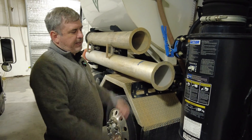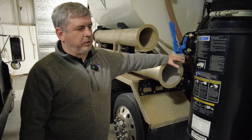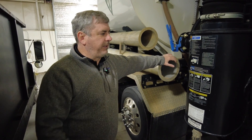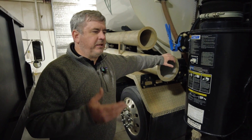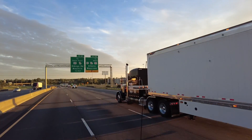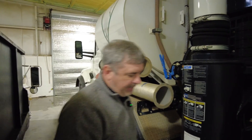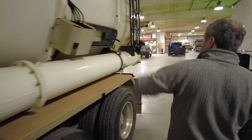The 28 inches of mercury is minus 14 PSI — that's not technically correct, but it's a good way to think about it. The factory gross on it is 79,800 pounds, so this truck is nearly 80,000 pounds. To put that in perspective, when you see a semi going down the road, they're rated for 80,000 pounds. This is a super heavy truck with the water. It holds 16 yards in the back, which is similar to what a big dump truck holds.